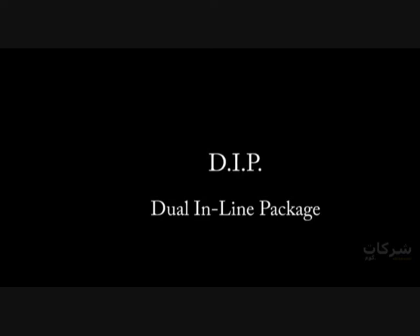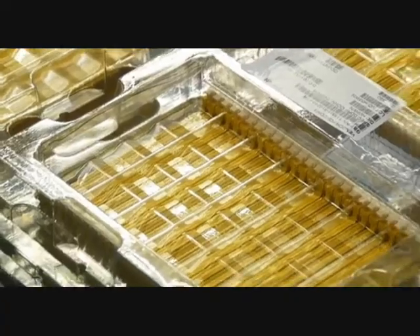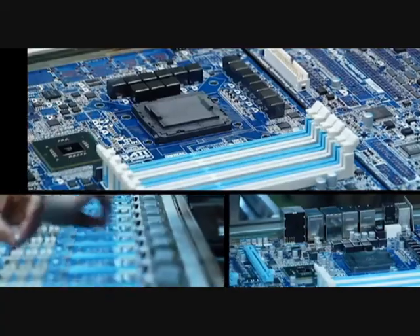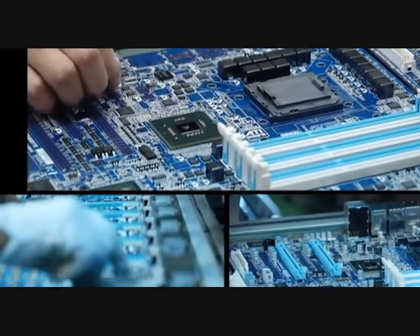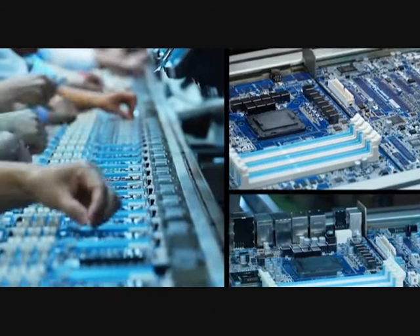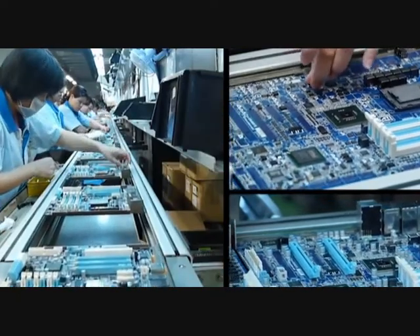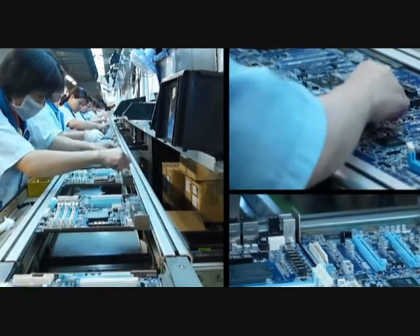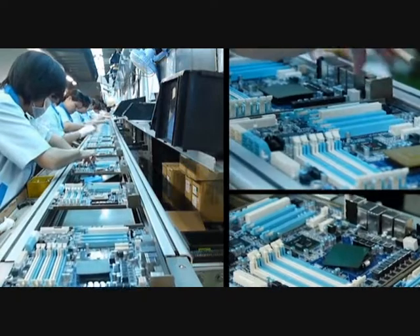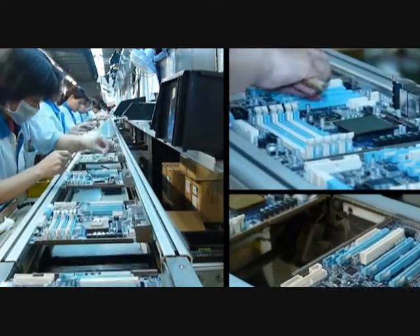Once these last tests are made after the SMT, it's time to go to the DIP, or Dual Inline Package stage — the second big important process when making a motherboard. First you have manual insertion: all the small components and chipsets have already been added, and now it's time to place all the other components that have pins going through the PCB. A long line of employees manually inserts the I/O connectors, power plugs, PCI Express and RAM slots, as well as the chokes and solid capacitors around the CPU socket. Before being finally soldered, each inserted part needs to be in the right place and well positioned — this is the goal of the inspection before wave soldering.